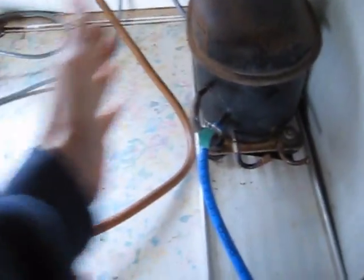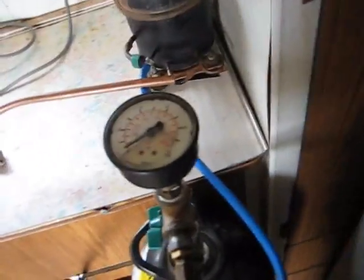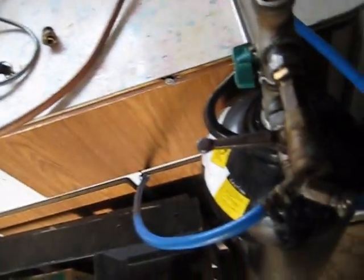I'll just have the compressor set up the way they work, except instead of using hoses they're going to be teed off into a manifold, which will be coming out. I'll find a way to connect that to there. I'll probably use as little copper pipe as I can — go from there with a brass fitting or something. Solder on the end of that where the end's broken off. We'll make it an expansion joint, flange it over that and just solder it on. Then some high pressure hose with good fittings so I can move it around and change the location — make it all portable.